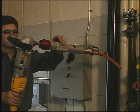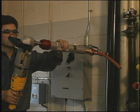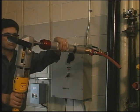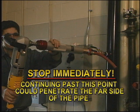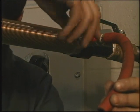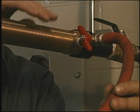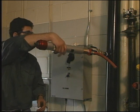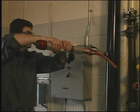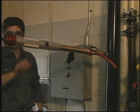Advance the sleeve until the cutter comes into light contact with the main, then back up the sleeve one turn. Resume turning the shaft and advance the cutter as before until the tap is finished. Stop immediately — continuing past this point could possibly penetrate the far side of the pipe. Open the bleed valve to wash away chips, confirm the tap is successful, and close the valve. Remove the ratchet or power tool from the hex on the drive shaft. Turn the sleeve counter-clockwise until all the threads of the feed screw are exposed and the sleeve comes to a halt — this action has fully retracted the cutter and the coupon.